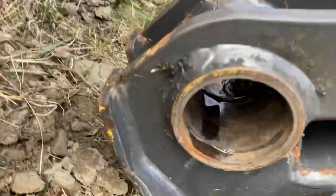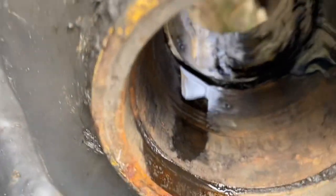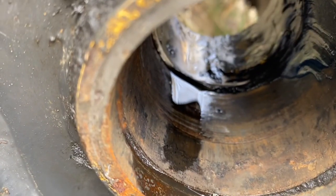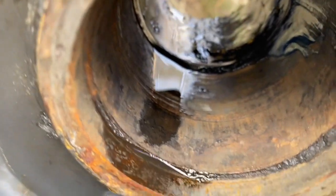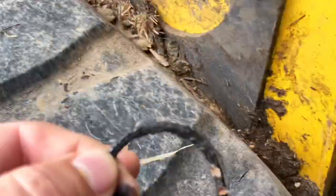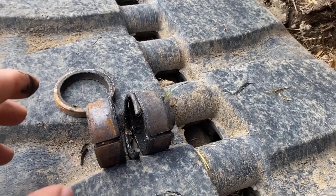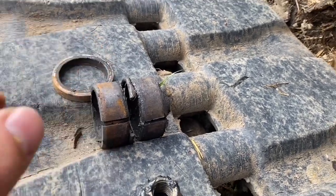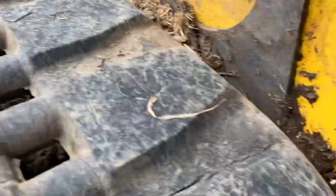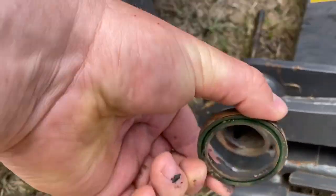Inside there you can kind of see it. There is a detent in the middle. You can see the far edge — halfway through the hole, you can see where the first bushing butts up against that. Halfway back this way there's a detent, and that's where this spring clip sits in between the two bushings. It prevents them from climbing up on top of one another when you have to take it apart. On the very outside edge is where this seal goes.